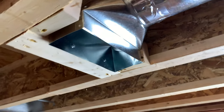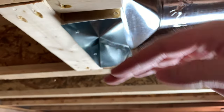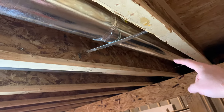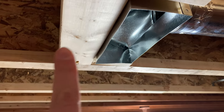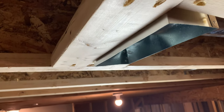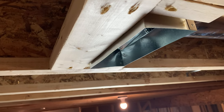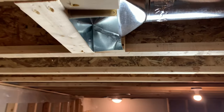But yeah, that's pretty much all there is to it. I know that this isn't completely level all the way across, just because there's a slight angle coming down, so it slopes down as it moves this way. But for sure on this front lip right here, that's a 1/2 inch difference. So that gives my drywall, which is a 1/2 inch drywall, somewhere to bump into. It's going to be nice and flush there and should finish up pretty nicely.